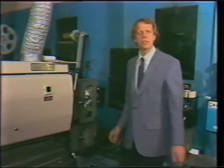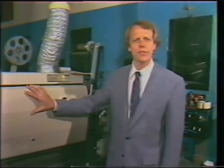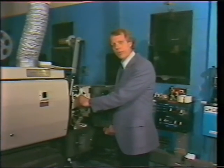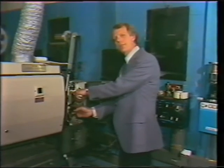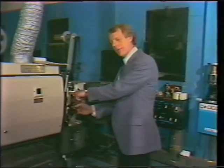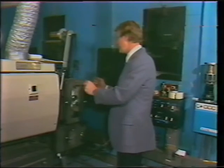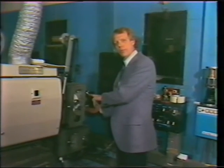On the feature, you can do the same thing if you know what to look for. Notice that the two images are vertically aligned — the horizontal misalignment of the images is the 3D. Any image can be framed up if there are strong horizontal lines for guides; often the opening credits will be a useful guide. So let's review: we've cleaned and adjusted the light source for maximum output, made and installed a new aperture plate with a 3D aperture, threaded the 3D film so the septum is centered in the gate, selected the proper focal length lens to fill the screen, and installed a 3D projection device to combine the two images on the screen.